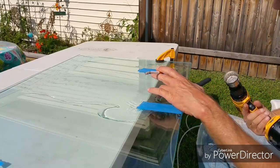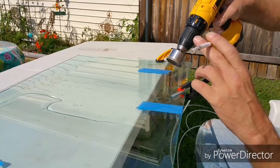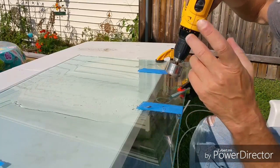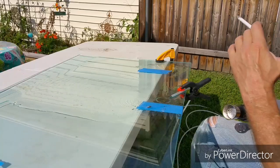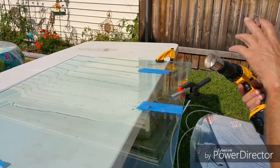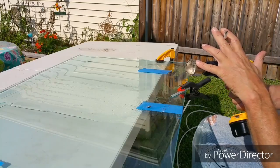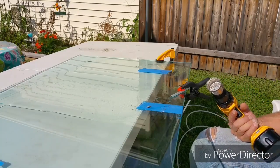I've started to drill this hole and I've got it good enough that it'll guide me. You'll notice the drill moving a little bit — that's because the drill is a little out of round, but not enough to worry about. For pressure, I just use the weight of the drill; I'm really not pushing down on it. You can go very slow, especially the first time you're drilling a hole. You don't want to go very fast, because even though you have the water on here, you can heat up the glass, and that could make your glass break and make your bit overheat. Once your bit overheats, it's kind of all over, because the diamond dust will become loose and fall off the metal, and then you'll just be trying to drill glass with a piece of metal — and that's not going to work.